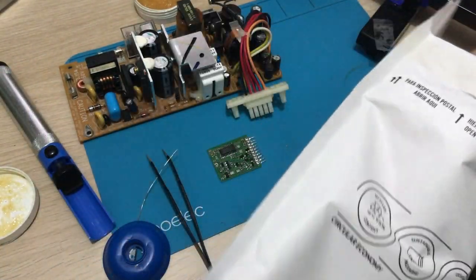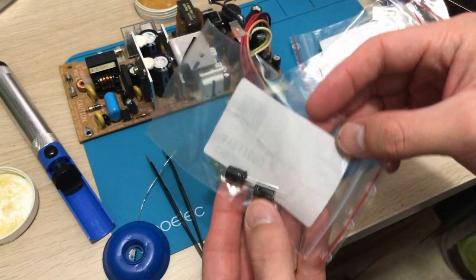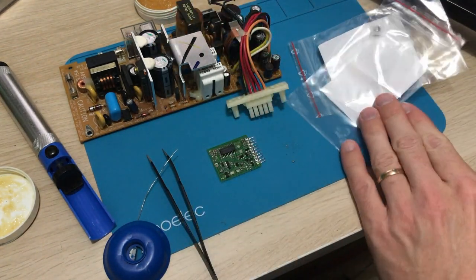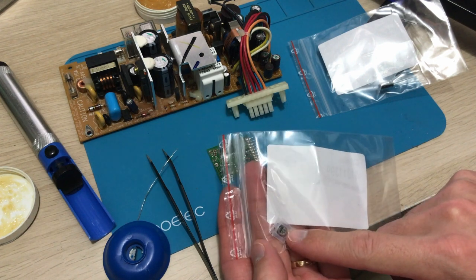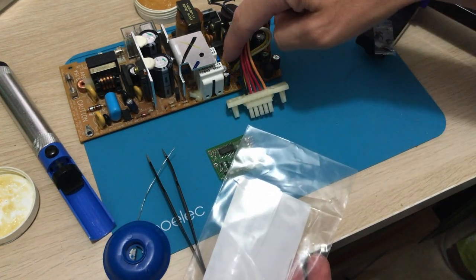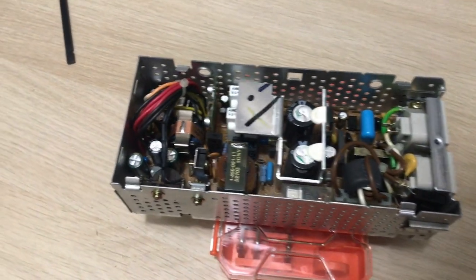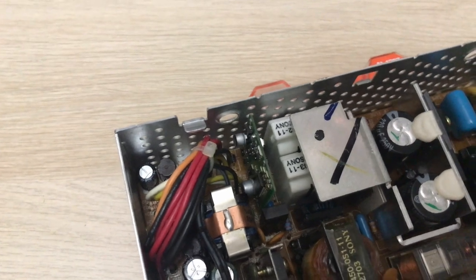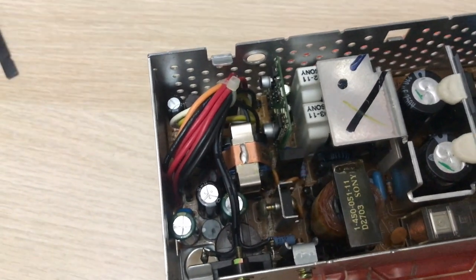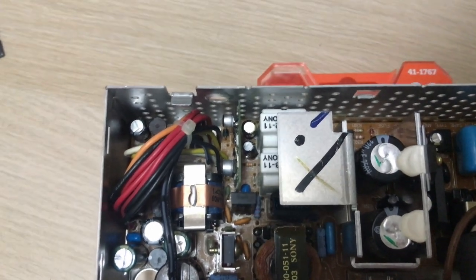I finally got the caps that I ordered that I was missing. We have the caps for the front corner, the little cap that goes between the big caps in the middle, the SMD cap for the daughter board that I was also missing, and the through-hole cap that will replace the homemade SMD version behind the daughter board. I've now put all the new caps back in their places and managed to get the PCB back in the cage. The only ones with green markings are the big chunky caps in the middle that don't need replacing — hopefully this power supply is good to go for another 30 years.